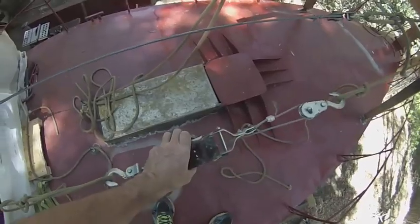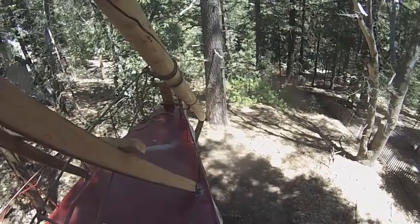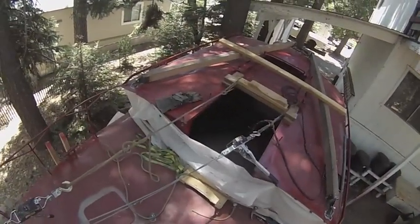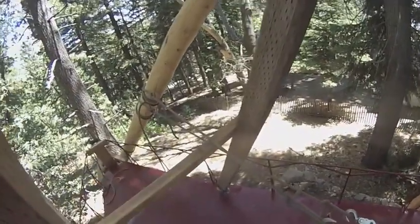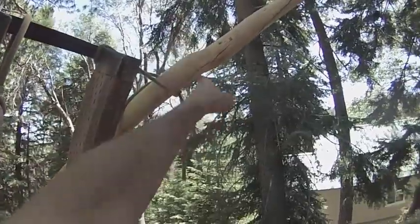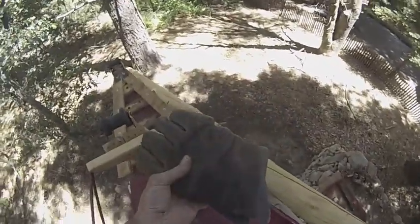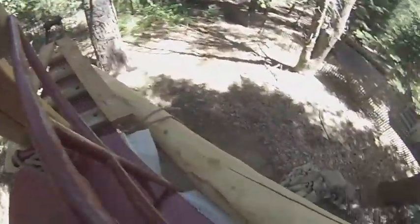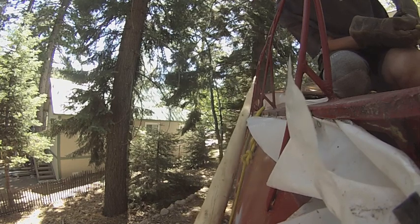It's on both rollers now. I was switching winches — tightening up this one in order to take the pressure off the other one — and while I was doing that I moved it off the rollers and it fell down, which is actually perfect. There were three safety measures that worked all at the same time: these winches kept the mast from falling down further, this rope kept the mast from falling over up here, and this rope in the bow kept the mast from falling down that way. I'm just going to put on some gloves, use the friction that this cleat will provide, and lower it down. Piece of cake — I'm not even using much of a grip at all.